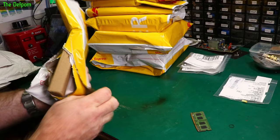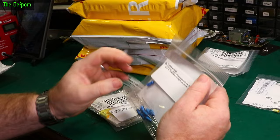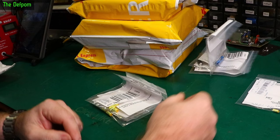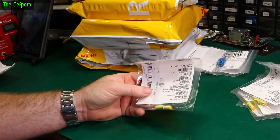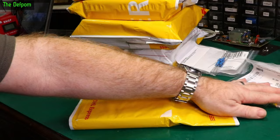More capacitors. So you've got some film caps here and some electrolytics. There's a kill-me-in-California one: 50 volt, 47 microfarad. 400 volt 15, 4K — so 150 nanofarad. 105K, 50 volt — so that's one microfarad. And a 474K, 100 volt. Basically I'm just stocking up on caps because I've got a severe shortage of all these kinds of film caps and certain electrolytics.